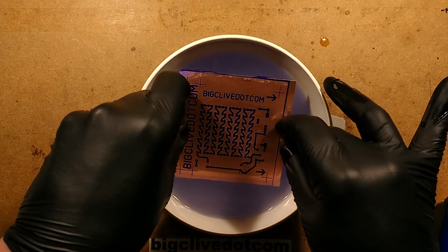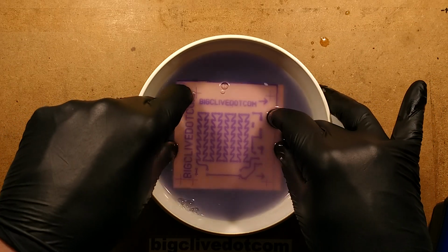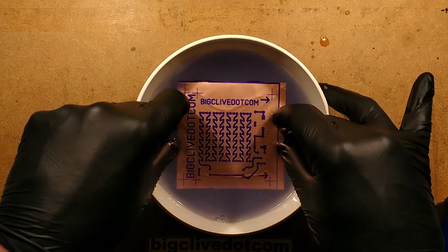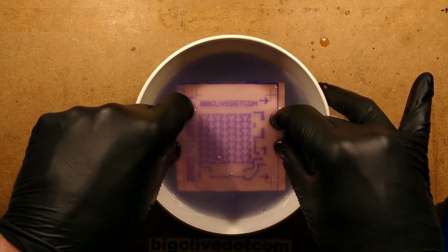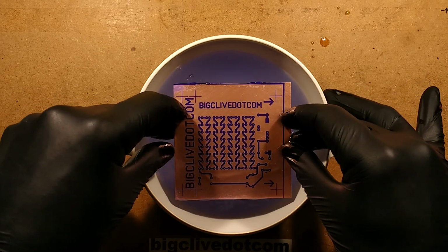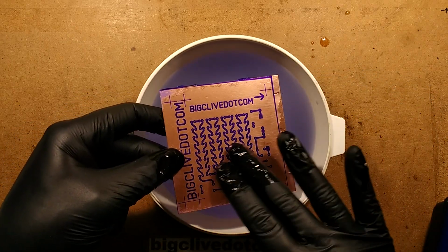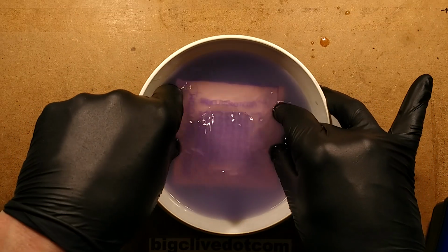I would have thought in previous circuit board development techniques, particularly my repeatedly failed attempts at printed circuit board making with laser printer toner, that was just terrible when you were trying to clean off the paper residue and leave the toner on the circuit board, quite often chunks of the toner would leave as well. I never had any success with that. It just didn't work for me. This works fine. Although with any of these systems, it takes a bit of getting used to. You have to experiment with it a lot.